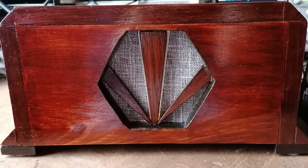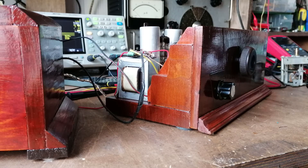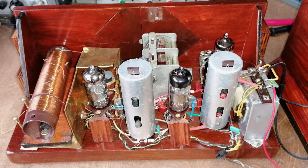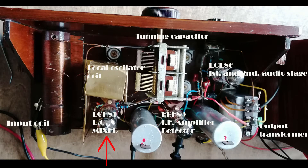Although IF is not constant as it should be, I have managed to pick up some other stations when conditions were right. Polish Radio 1 is the only station on long wave that I listen to from time to time anyway. My design uses three tubes: ECH-81, which is a triode and heptode — respectively local oscillator and mixer — EBF-89 for IF amplifier and detector, consisting of two diodes and a pentode, and ECL-86, which is the first and second stage audio amplifier.